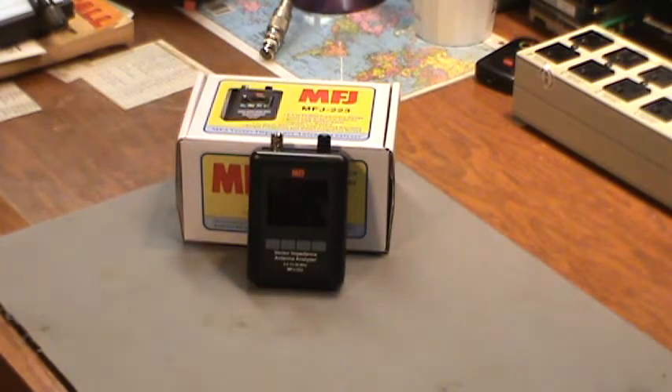As shown in the test I did on the new HDTV antenna, the discone did pretty good. Now, the characteristic of the discone antenna, at least the type I've got, is that it's pretty good on a wide band of frequencies from about 25 megahertz to about a gigahertz. It does a pretty good job, and I can actually test it on the lower part of that band.